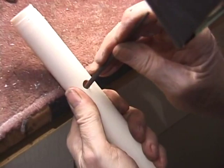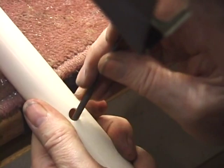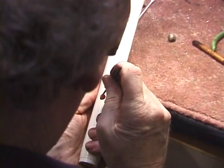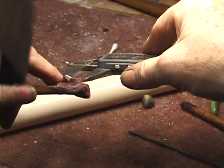And we want to know what shape we're making in there, so from time to time I have to take a little molding in plasticine or silly putty or children's modeling wax. In Scotland it's called plasticine, on the end of a piece of wood, very powerful technique. We introduce that modeling wax into the bore and press up into the mouth hole, and it will give us an impression of the shape that we're working on. There it is, and then I can take some measurements and see what's happening there and what I want to continue to adjust.